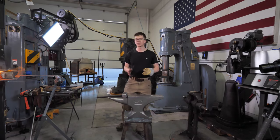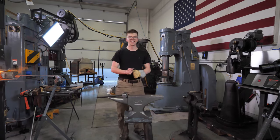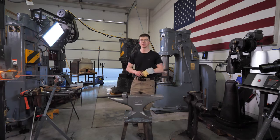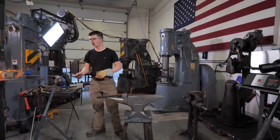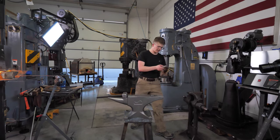Means I don't go off course as much. A lot of folks do just fine hitting three times with the punch and then taking it out. But if I was a beginner, I'd find it easier to just hit once, take it out. Especially if I didn't have the best steel for my punches because they'd be more liable to be distorting. And so if you don't have the best hot work steel for a punch, it's really good to take it out, make sure you don't damage it quite as easily. Okay,